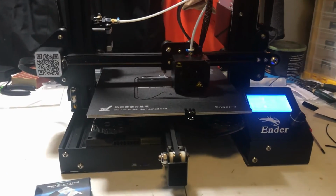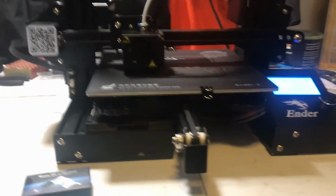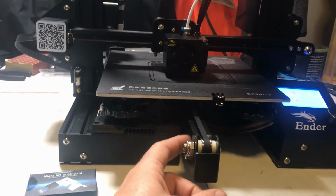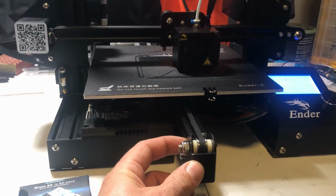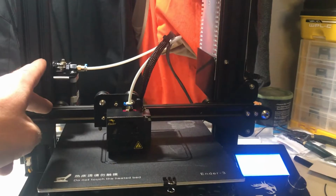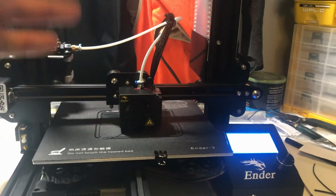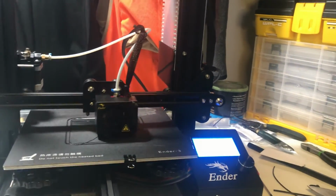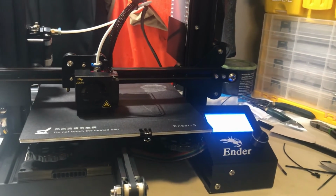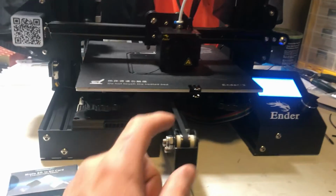But you know what, what a machine. And I'll tell you this right now, the minute that you start to print, get your Allen wrench to tighten up your tensioners, because this tensioner here is going to need to be tightened up. The one that you've put on here, mine also needed to be tightened up, and I thought I had it perfect, but it's just your little tensioner here, it's two screws, it's super easy. So have that out and ready for your first print.